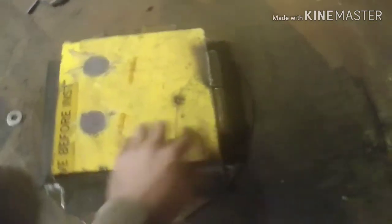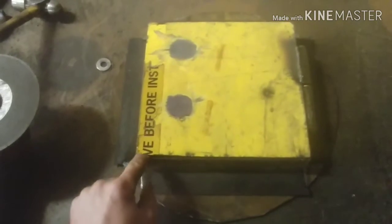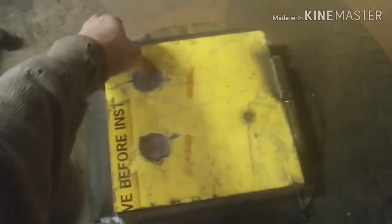I love these buyer's hinges — they're super, super strong. Since I only used one hinge, I had to add an eighth of an inch of slop into the bottom of the door. So when I welded the door up, as the hinge sags, it lines up and closes all the way. So it should be pretty airtight on the door side.